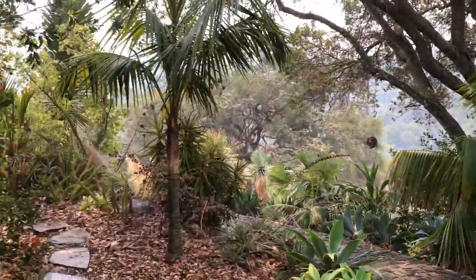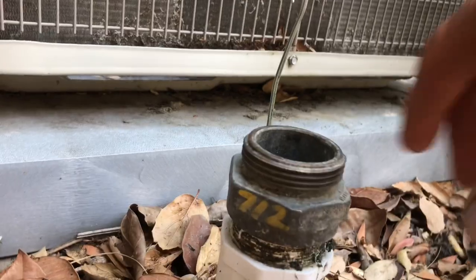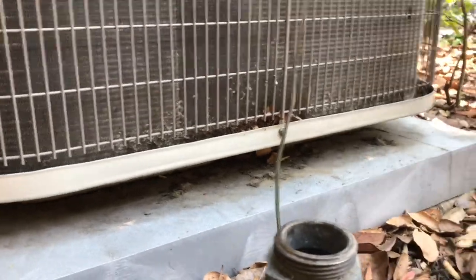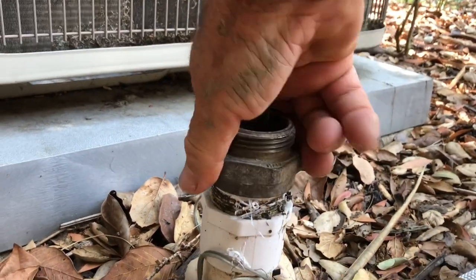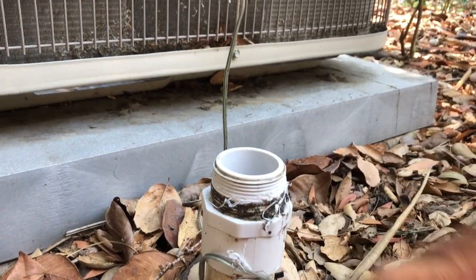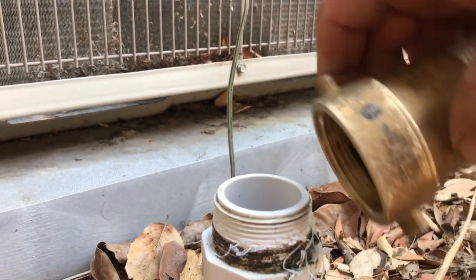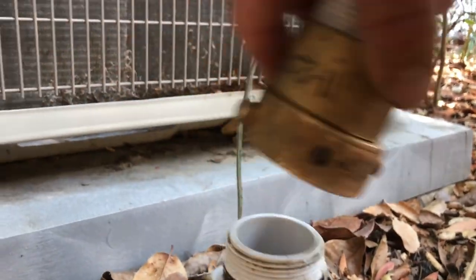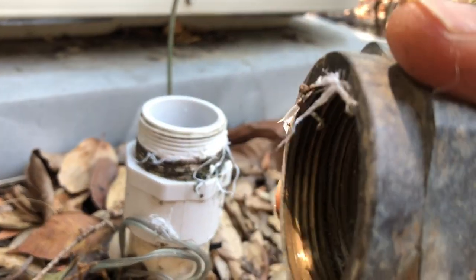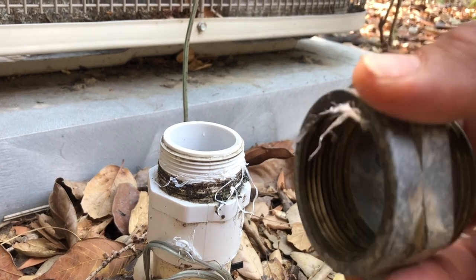Here's my garden, which I hope will be here tomorrow. Here's another one of my inch-and-a-half tap points. This adapter piece here is critical. When you have PVC threaded pipe it's going to be standard pipe thread, but fire hose threads are different — see how much bigger and more spread apart these are? These are hose threads, and they won't fit directly.